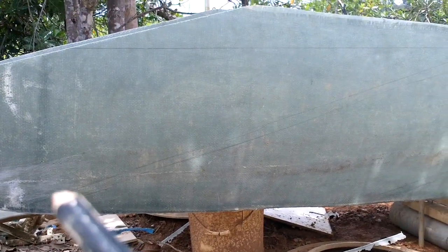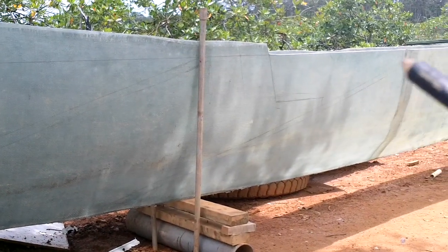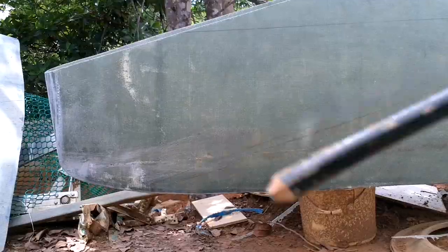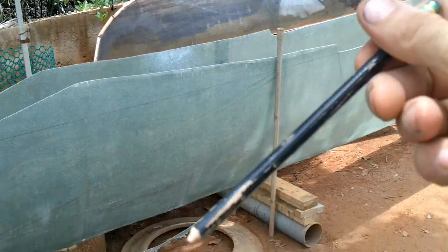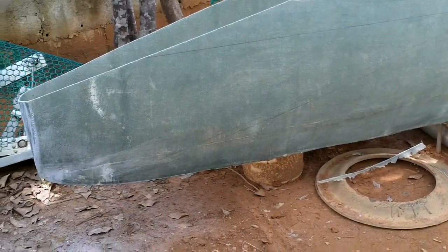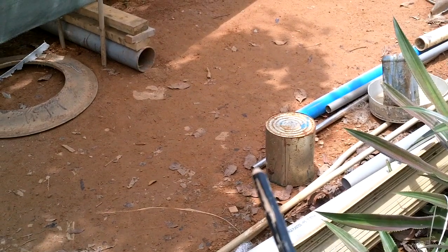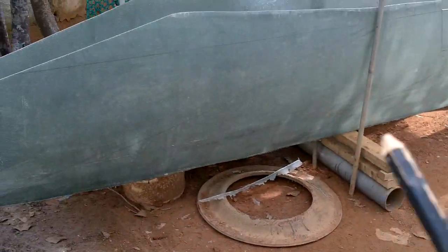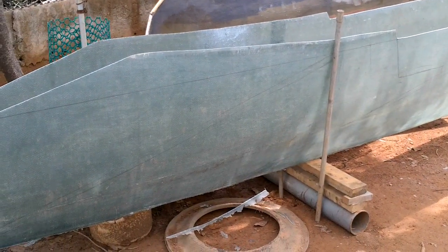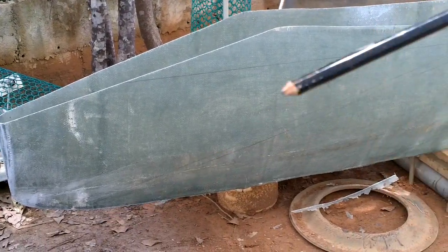And then back here, there's the line. Hopefully the camera can see the line there and the one here for where I want to put the pipes. The pedal pipe I'm going to make thinner than the motor pipe, because the pedal one's not going to have as much power as the motor one. The motor one is going to be a hollow 1-inch diameter tube. And the pedal one, I think I'll do a 1/2 inch. So I can use a smaller tube here and a bigger tube here.